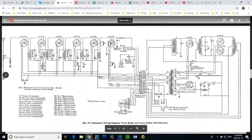I don't have non-electrolytic that are that large, and one of these already is an electrolytic one. So what about the C5 here, 0.001? That's no problem to change if I can spot it. And C11, 0.125, across this coil.